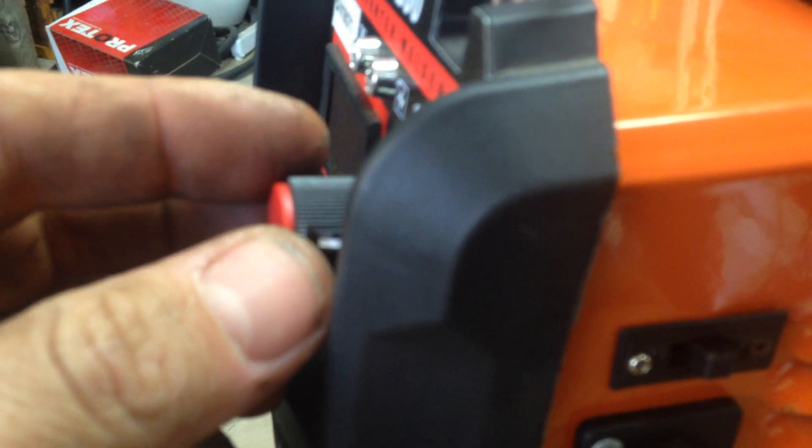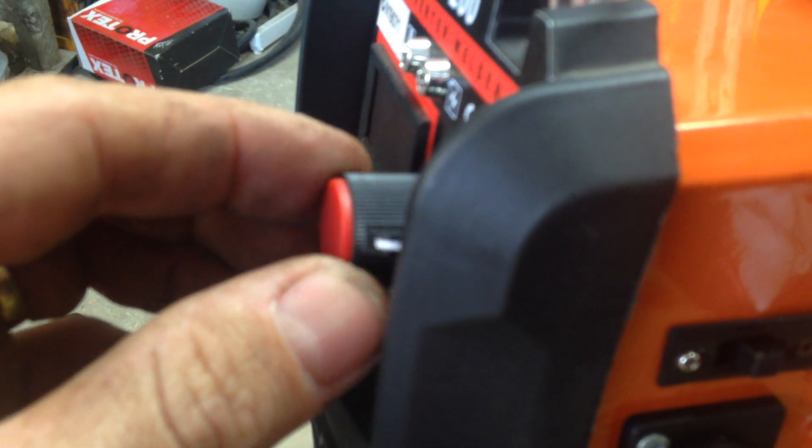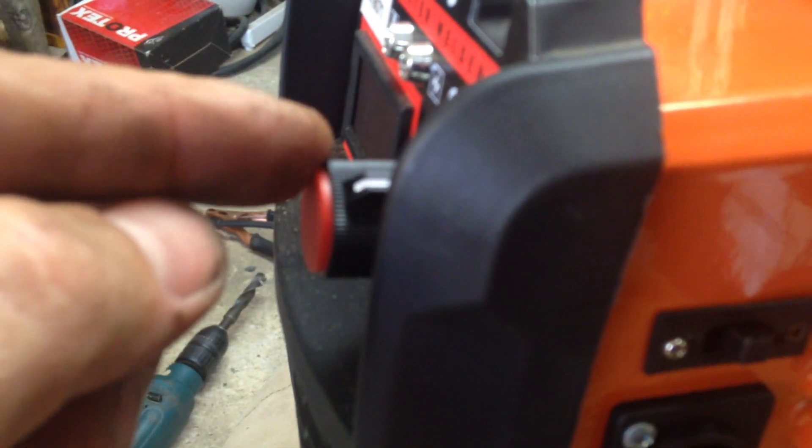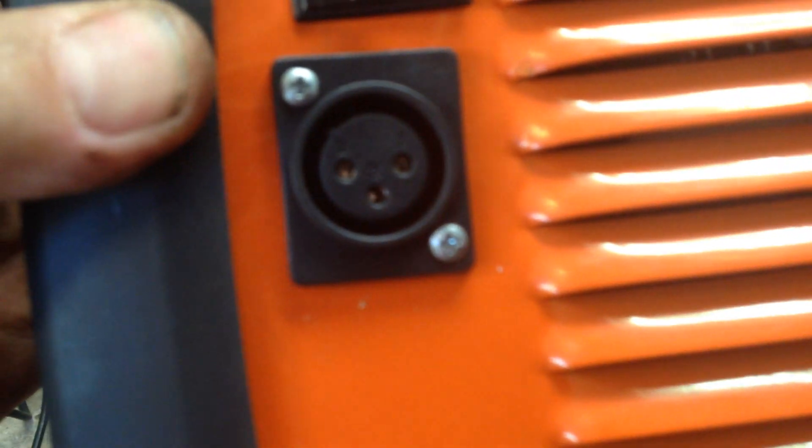I've also put a switch in here. When you turn it off, it turns this pot off. When you turn it on, you can get more feel. You can max your amps to about — well this goes to 200 — so you can max it to say 100 and then from there use the pedal. If you leave it off, everything goes to the pedal, which is what I like to control it that way. So that's just tapped into the pot in the machine.